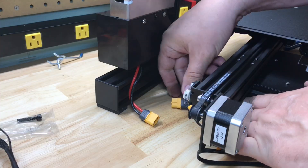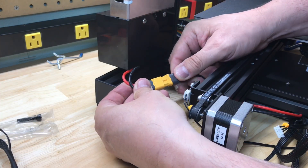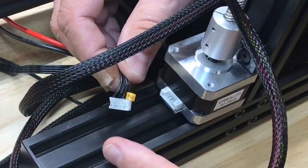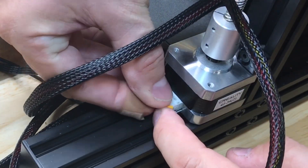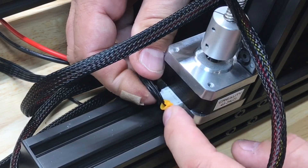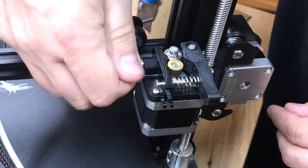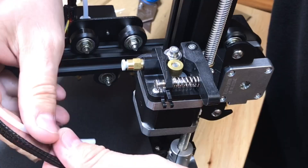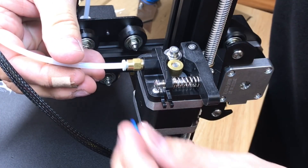Connect the two yellow connectors by going under the arm and snap them into place — this is your power. The Z connector goes into the base motor and there's only one way it can go in; it's keyed. Push it in place and then move up to the extruder. There's a connector that you screw into place — I just hand tighten this — then slide in the PTFE tube and put in the little blue locking clip.